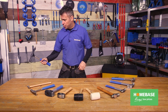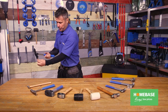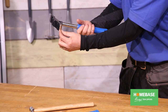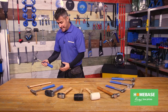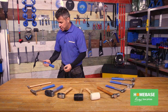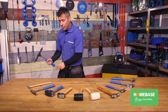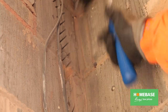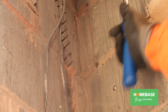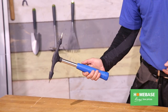This unusual hammer is called a scutch hammer. It's a double-ended one with removable blades in both ends, designed for dressing brick and block work. If a brick is dirty with mortar on it, it can be easily chiseled off and cleaned up. It's also good for chasing out lines through a soft masonry wall if you're installing pipes and electrics and want them to be flushly plastered over. The shaft is a tubular chrome-plated shaft with a soft grip handle for comfort.